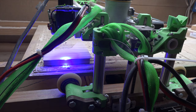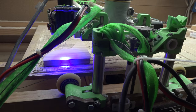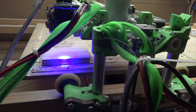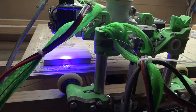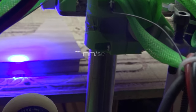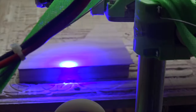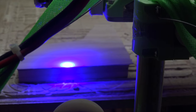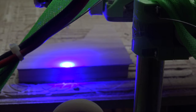That worked out quite nice. I just wanted to show you the laser engraving — this is the actual speed, really, really slow. I was running at 20 inches per second, and then I reduced the speed to 20 percent on the control board there.